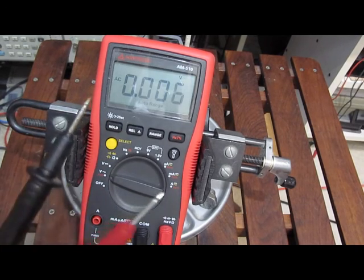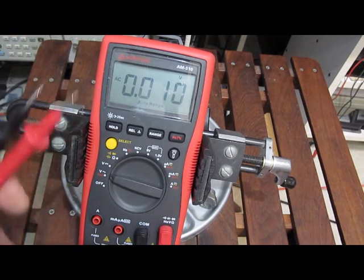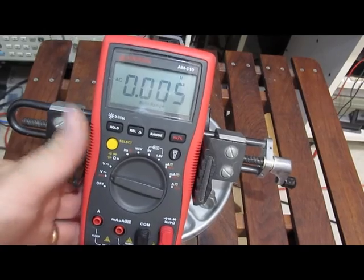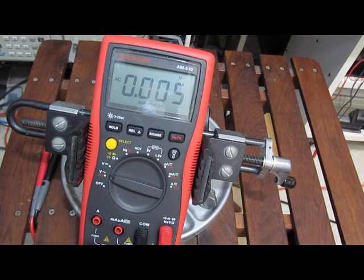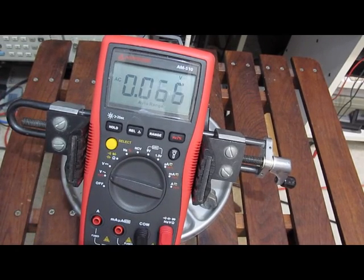Having a meter that would fail a test like this would be pretty pathetic. People look at the high voltages some of these generators can put out — over 10 kV — and think there's no way the meter will survive. But that's really not the case. The surge testing I was doing was in excess of 10 joules toward the end of the test, and here we're talking about basically nothing. It's not the voltage that's going to take out the meter — you have to look at the overall energy of the signal.